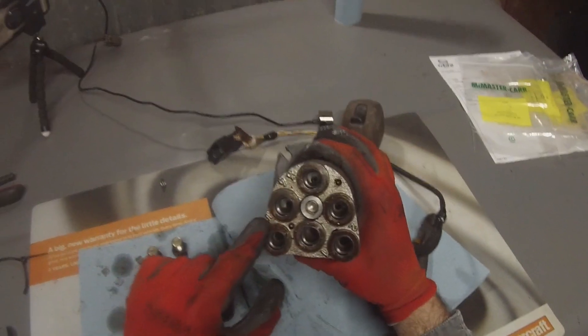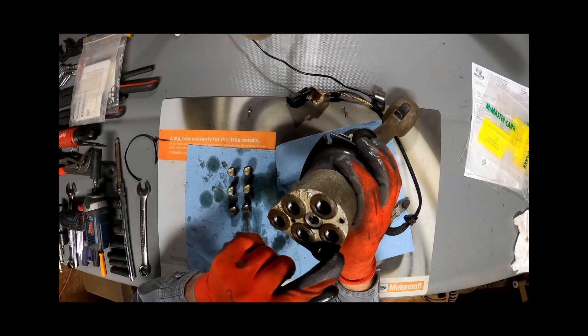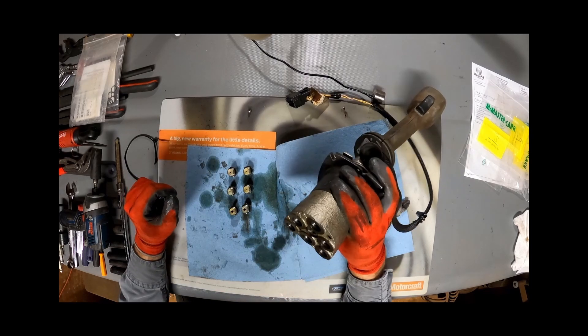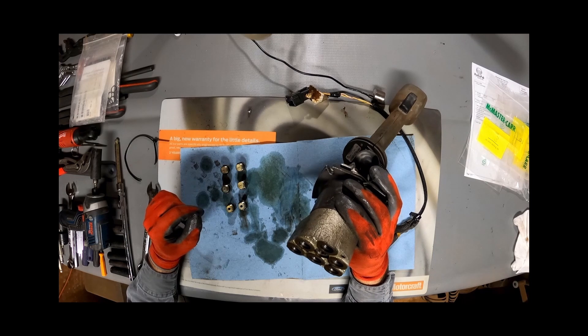This one's actually marked T — you can see right there. And then these are marked one, two, three, and four. If you reference that to the hydraulic schematic, that tells you what function each one of those does.